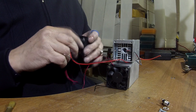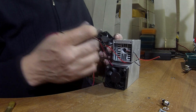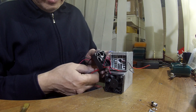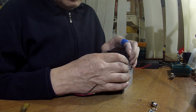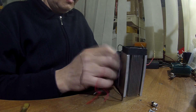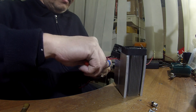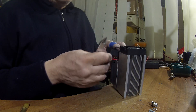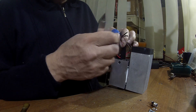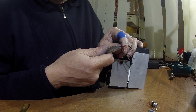Let's screw the fan. In this new modified version we have only two AC/DC units — one for the laser and one for TEC cooling plus fan. We have all wires cut to a certain length. Red is plus, black is minus, as usual.